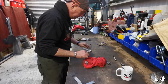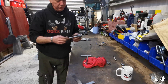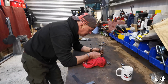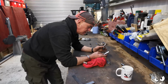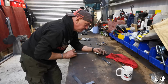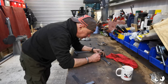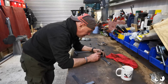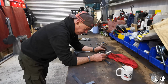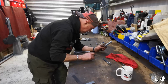Right, so, where do I want to have that bottom off? Right, probably wants to go quite close to, I would think. About there. Because we're still going to have, so if that's going to be the top of it, pretty much where the weld stops, then we're probably going to have like 4mm of rubber, and then we're going to have the cap that comes down from underneath the cooler. It's probably going to be about there, isn't it? Right, let's chop that off.